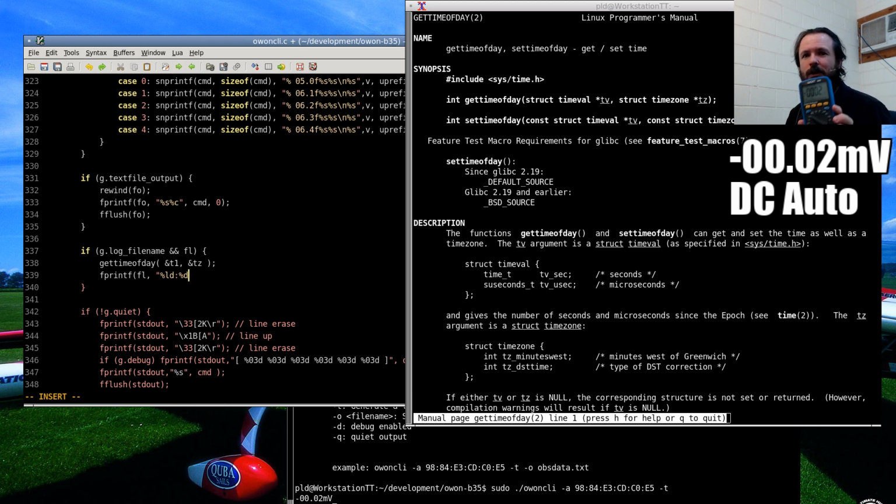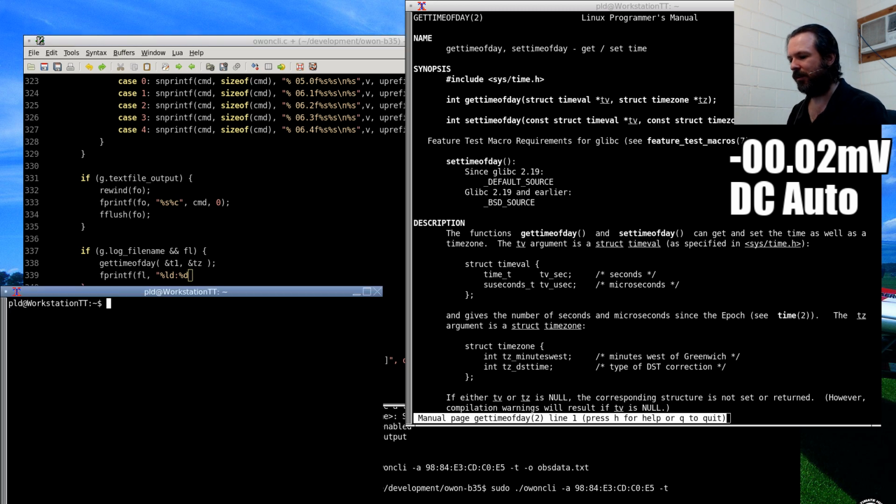So this is just the straight B35. You can get the T, which is the true RMS. You can get the Plus, which has data logging built in. But this is just the straight plain cheap one, and it seems to have everything that I need. The count rate is about 6,000 counts on this. So it's good enough for what we're doing in terms of diagnosing laptop boards and things like that. It is not a high precision meter. It is not a fast meter. But it's good enough for what we're doing. So that's that. As for the adapter on Linux, I've got two different ones. Let's see if I can...